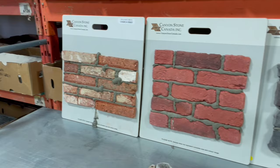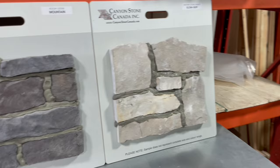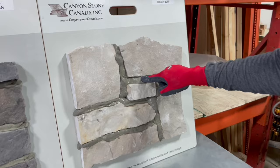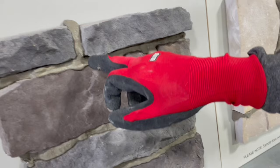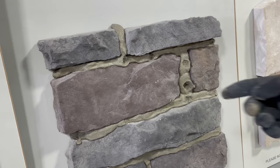Now a very important step is checking when the grout dries - there are different drying times. Our reclaimed clay brick can dry anywhere from 10 to 30 minutes; our natural stone could take up to three hours. The way you check for drying is you just poke it with your finger. This one's way too wet - you can see I'm pushing and smearing the grout around. This one is a little drier but still too wet - I can push my finger all the way through, and that's not what we want.